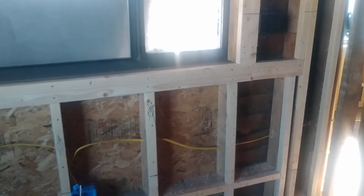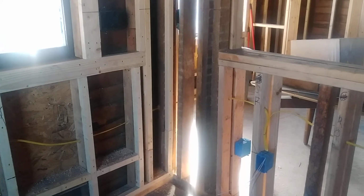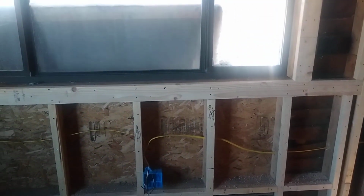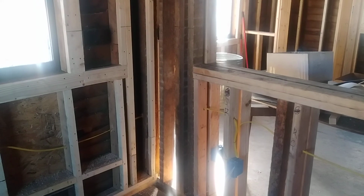One thing, these exterior walls, I furred them all out another 2 inches. They were originally 4 inches. I heard from my electrician that the city's requiring, on all renovations or remodels, that we use 6-inch insulation on the exterior walls. I had been contemplating doubling those walls up anyway for sound purposes, because there's dogs in the neighborhood that bark, and I'm probably going to have some sort of acoustical treatment on all the windows anyway. So I thought it was a good idea to thicken up those walls, make them 6 inches, and help absorb some of the sound from the outside.